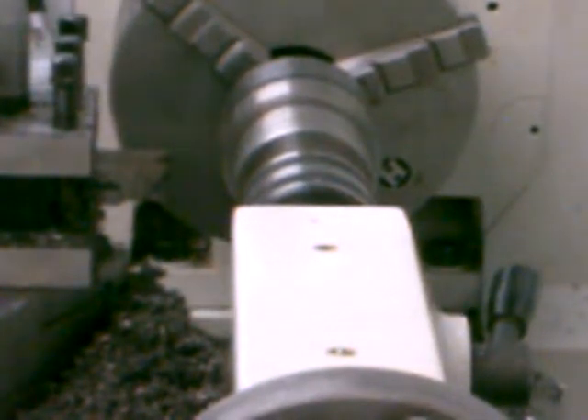As you can see there, I did manage to figure out a way to set up my parting tool on that tool post. It's not ideal, but I managed to cut most of the way through there with it. That parting tool is three-quarter inch, which sets it just a little too high — it's above center, so I can't go all the way into the middle there. But I got most of it, and I think I will probably hacksaw the rest of it, but we're getting there slowly.